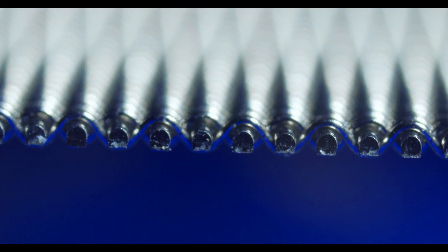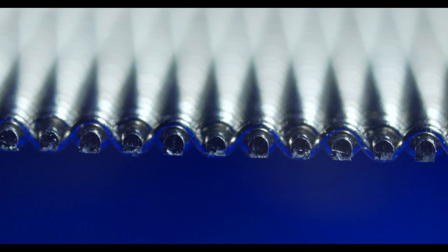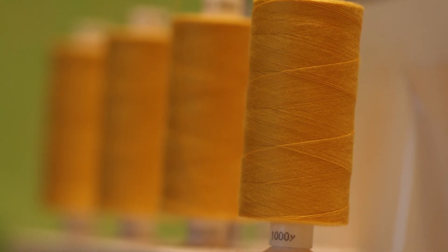Stainless steel wires are also more stable than polyester or nylon. It can withstand hard conditions, even at the smaller opening sizes and thinner wire diameters. And with nylon or polyester, there's a limit to how fine or thin you can get your individual threads down to be, because they just can't withstand the tension and stretching that's actually needed. But stainless steel woven wire can be drawn out to a very small diameter and still be able to be stretched and tensioned without suffering any alterations to the mesh itself or the process.